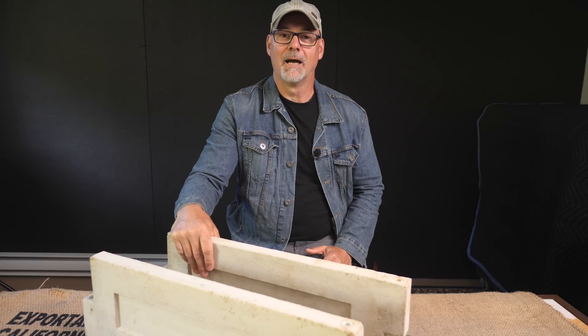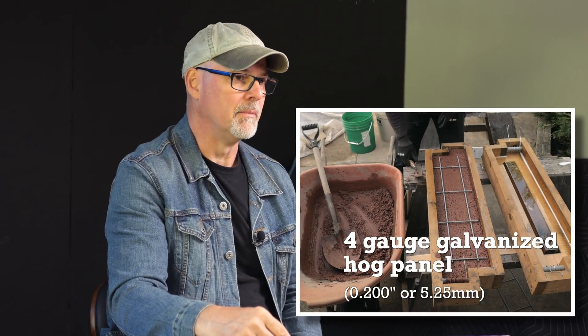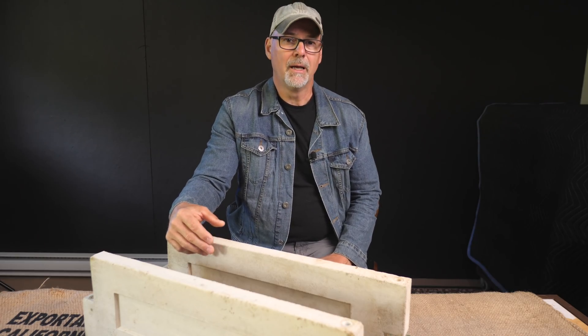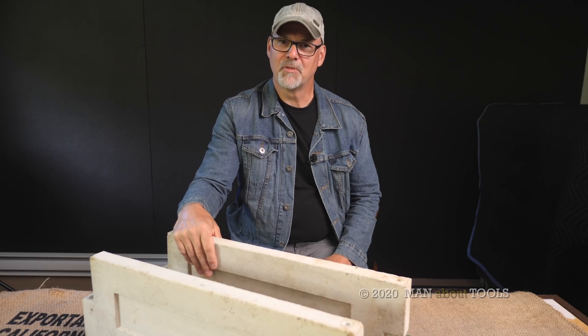I had hoped it could take more weight, and I also hope my wife Marilyn doesn't kill me for that. Looks like I'll have to make a replacement, and when I do, I'll use a heavier gauge wire mesh — I like the galvanized hog panel fencing I used in some of my other lightweight concrete mixes. But even at the breaking point of 285 pounds, I think the panel is strong enough for a garden box. I like that it didn't show any fractures around the pipes where the concrete is the thinnest. The CSA concrete is very hard and durable, and the panel showed no damage at all from the line trimmer test. I hope that was helpful — leave me a comment with your thoughts, and thanks for watching.